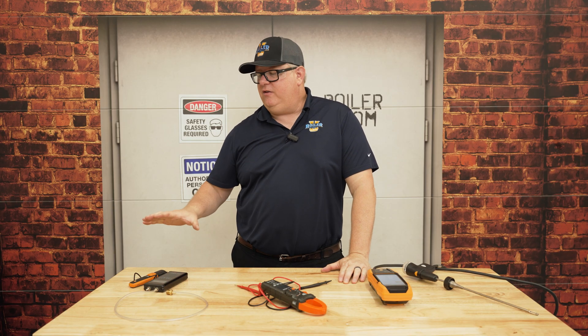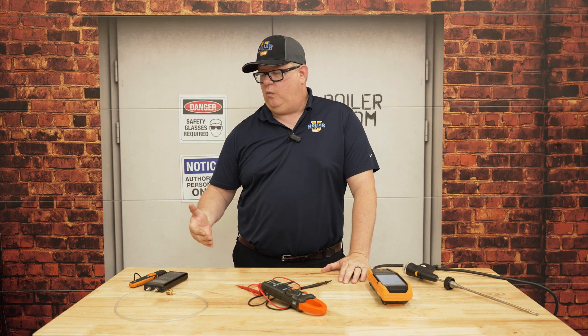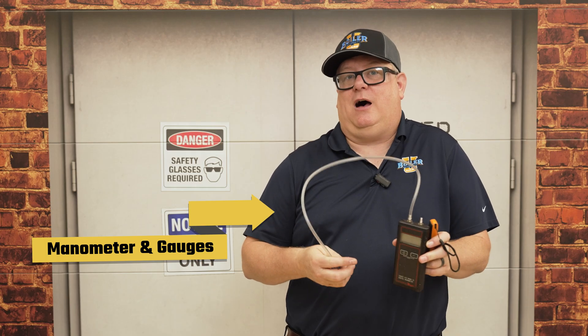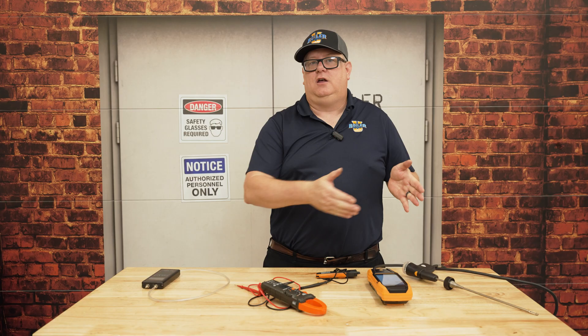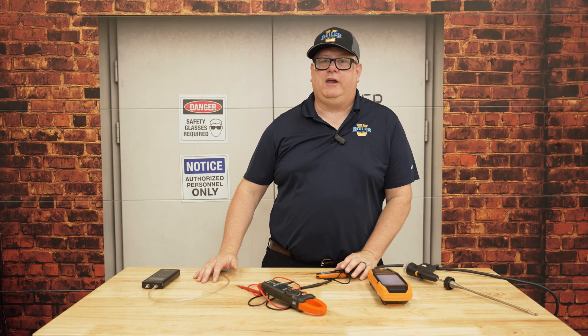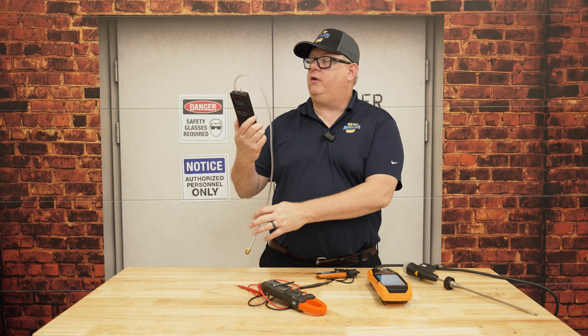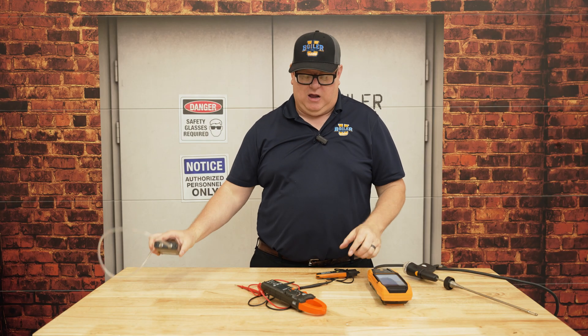The last one is not as obvious, but it's combustion-related and troubleshooting-related as well: manometers and gauges. A good digital manometer is far more reliable than a gauge that's existing on a fuel train, because everything works until the day it breaks, and that gauge may or may not be trustworthy. Bringing a digital manometer that's appropriately ranged for what you're testing is better. With some of the new technology, you can Bluetooth directly to your phone and trend pressures over time — and that ability may be the difference in catching instability coming out of a regulator that can cause issues.